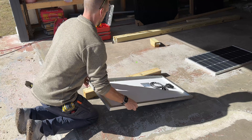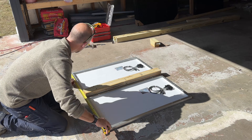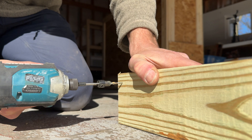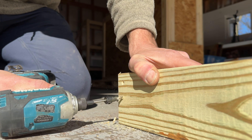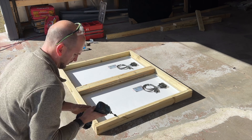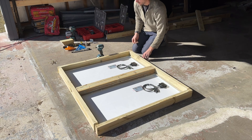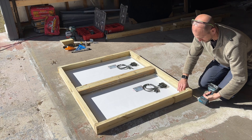Once we have that, make sure you're oriented in the right direction. I'll sit my two 100-watt panels flush with the ground and start to build out my frame using pressure-treated 2x4s. I'll countersink three holes in each of the ends so I don't split the wood when driving my 3-1/8-inch exterior-rated screws in. I'll go around all four corners and then sink one screw in each corner first so I can double-check that everything is squared up.